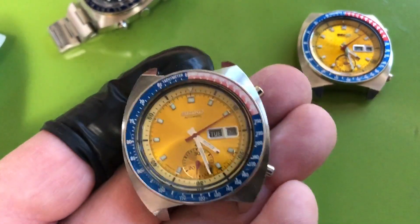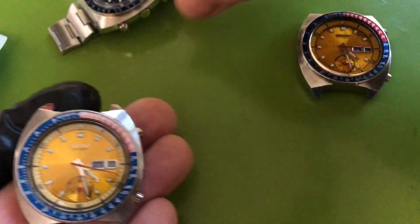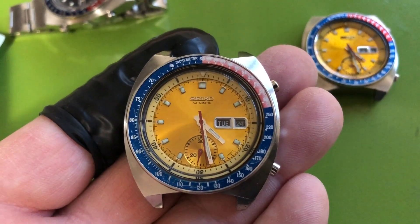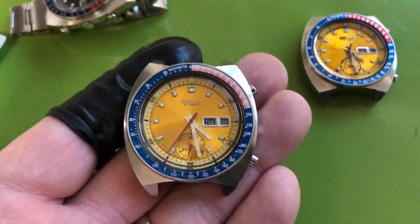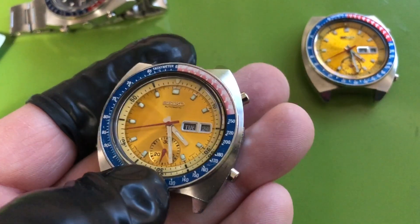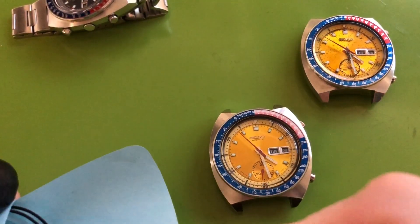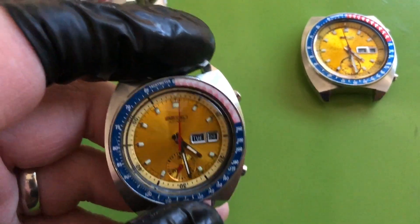Now this one was a humdinger — yikes, this was a lot of work. Thank you for telling me not to worry about producing servicing videos for these two, because it really does add to the time. This one had a mix of moisture inside — a good amount of moisture, a good amount of corrosion — but also somebody had oiled the heck out of it, like it was filled with oil. So you had water, rust, old lubricants, and just an overabundance of oil everywhere. The mainspring barrel was filled with oil. It took a lot of extra time to clean that up and do corrosion remediation.